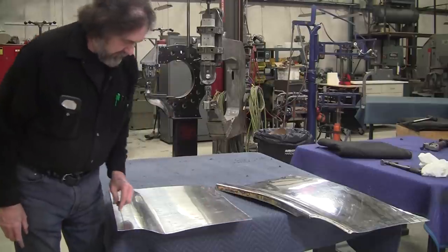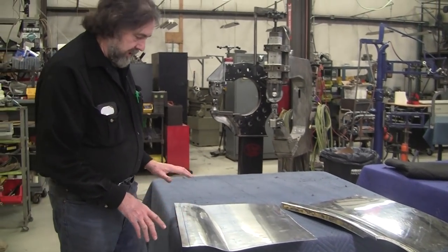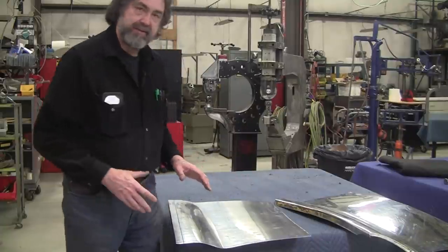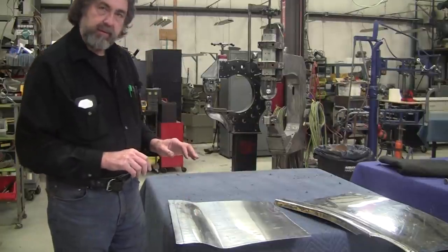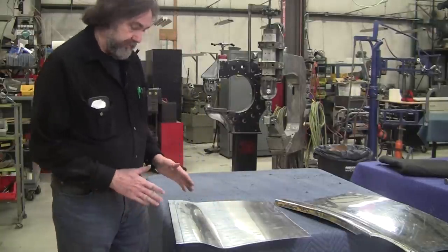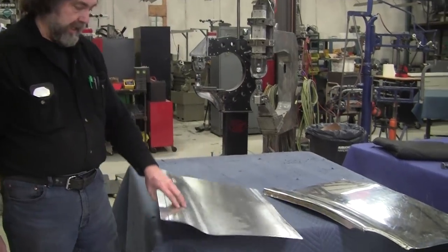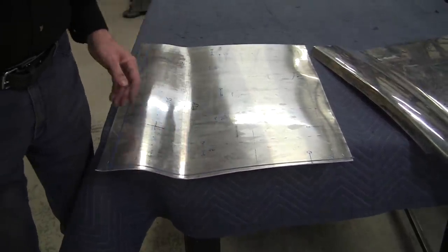to that line there. And the way to generate those lines is we put the flexible shape pattern on there, and then we'll take a super fine pen and we'll draw the line. Now the flexible shape pattern can have a little bit of raggedness to the edge, depending on how you cut it when you make it, but generally, as you use it, it gets a little raggedy, so the line might wander a little tiny bit. So I use this 1/8 inch vinyl tape to idealize the line. Don't deviate much. It could be only a matter of like 20 thousandths of an inch one way or another.